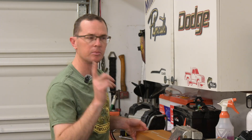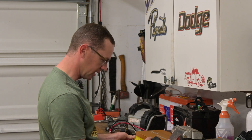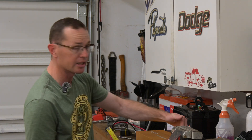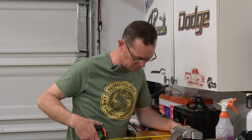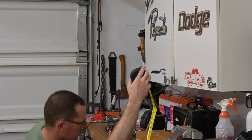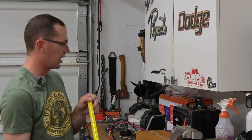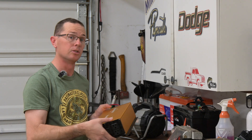It's about nine pounds. For packaging, you'd need about 15 inches or so, plus the plug hanging off the back. Overall width is around seven and a quarter inches, and overall height is about three and three-quarter inches. Overall it's a little bigger than a group 30 or size 31 battery.